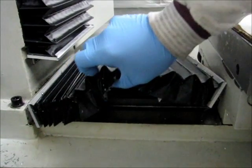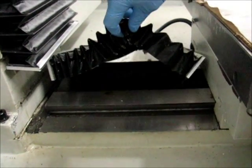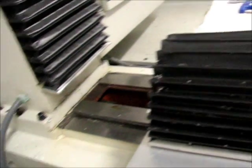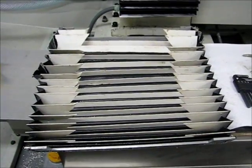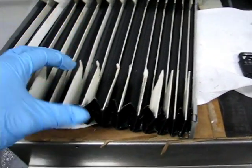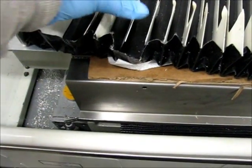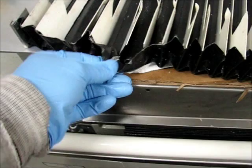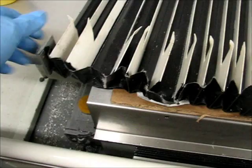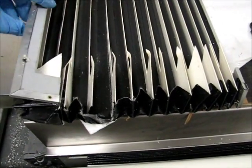This one is so damaged it comes off fairly easily. Now you can take a look underneath and see what sort of rust you have collecting — hopefully none. With the bellows removed, we can clearly see the damage: the corners get bent over when forced up off the dovetail, and then the plastic supports get torn out of the rubber bellows portion. This is how it started to fail and indicated that I needed a new one.